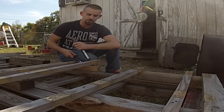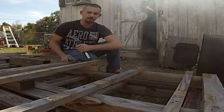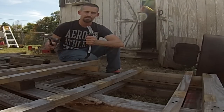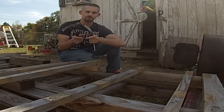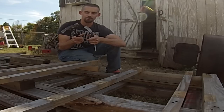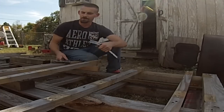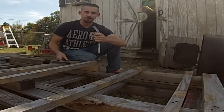And that not only goes for pallets, but also other types of things like nuts and bolts. Sometimes if you just have a hammer and just tap it, the vibration kind of shakes things up and loosens all the friction of everything where it's connected. And it'll really help get everything loosened up, and it comes apart a lot easier.